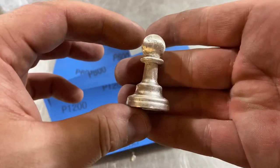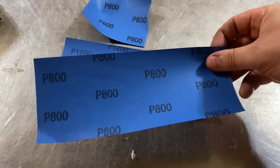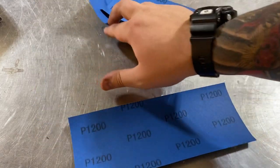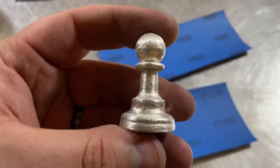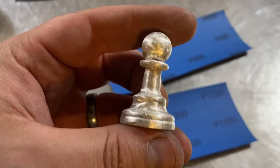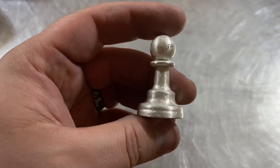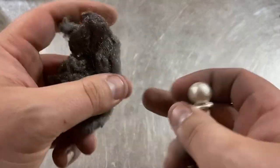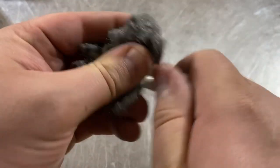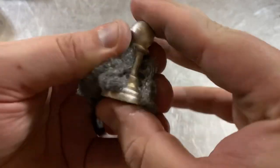Once you have the piece looking the way you want, it's time to start with the final sanding. I use 600 grit, then work my way up to 800 and finally 1200. You can use whatever grits you want and go up as fine as 3000 or 4000, but I find 1200 is enough. After the 600, it starts to look pretty nice, but we can do even better. So I hit it with the 800, then after the 800, we do the 1200. The final thing I use is steel wool — make sure to get quadruple zero, as that's the finest you can get. This does a really good job getting out any small scratches so we can get a nice polished finish.